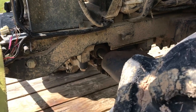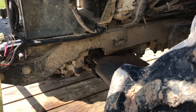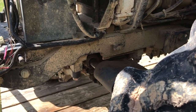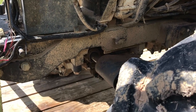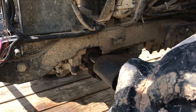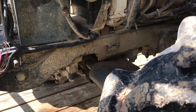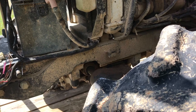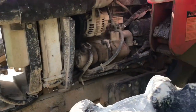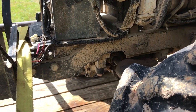Which of course is a total pain in the butt. This morning I was trying to do a little job — just blading out some rock. I bladed out two dump truck loads of rock for a lady for a place to park her cars, a quick little easy job, but it was a pain in the butt because I couldn't hardly steer the tractor at all. You kind of need maneuverability when you're trying to blade out rock and put it in the right place. I actually had the manual throttle revved up just trying to keep the engine spinning faster to get my pump running faster and get that oil heated up — which basically loosened up and started working right at the end of the job. Go figure.